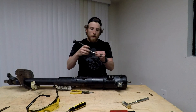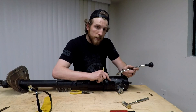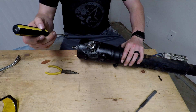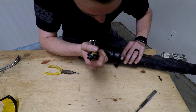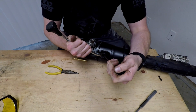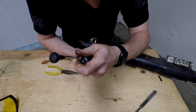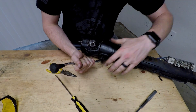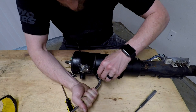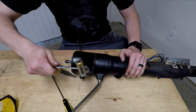Now we have our arm that we need to get in here. There's only one way that this goes in and that's going to be with this notch facing down. We will have to compress this spring in order to get this lever in, so we're going to bring out our baby screwdriver first to see if that'll work, since it's thin enough to stick in there. Make sure the holes are lined up, then take our pin and get it in there. Now the final touch — hammer it back in.